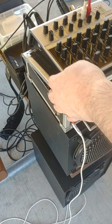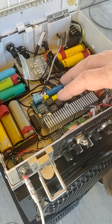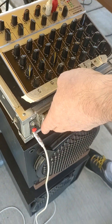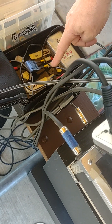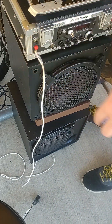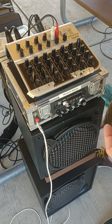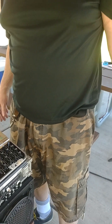Here's the business end of it. These two batteries power the preamp — I added that preamp. Here's the main amp board. These batteries power the mixer, and there's an MP3 player. The power amp is back here. These two significant batteries are 12 volts each, so that's 24 volts coming in to power the big PA speakers and the subs. On the back of this box — which was a Hannah Montana case, silver but with purple on the inside, and I painted it black — there's a right and left jack going to the satellites, and one on the bottom going to the sub. I used all shielded cable for the audio paths inside, so I didn't need to worry about shielding on the plastic chassis.